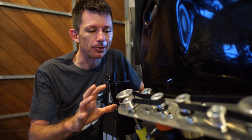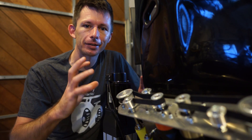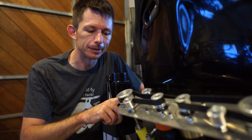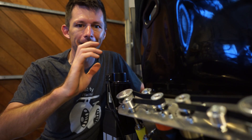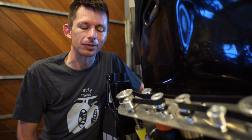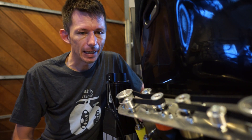One of the learnings I made early on is there's a lot of force going through all of the system, and when that force is there, stuff starts flexing and shifting relative to each other. I wanted to make the mounting a lot simpler and remove that force-bending from the equation. So I designed this bracket. Commercially, they solve this by using a honking great metal seat that's solid as hell and weighs a ton and doesn't move. The problem with fiberglass seats is they bend, twist, and flex. So I designed this bracket in Fusion 360, sent it off, got it laser-cut and CNC bent — it comes back absolutely perfect — and that's what I hang everything off.